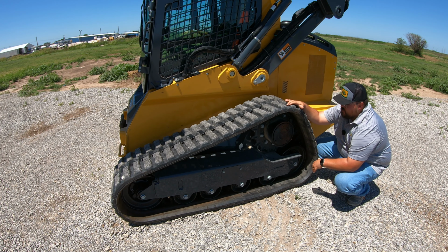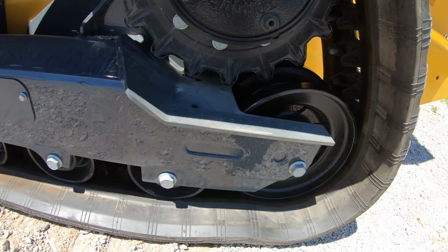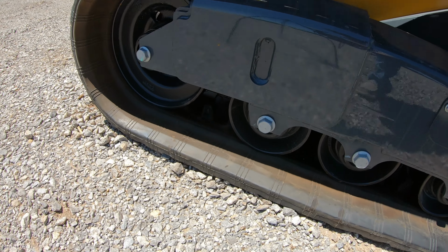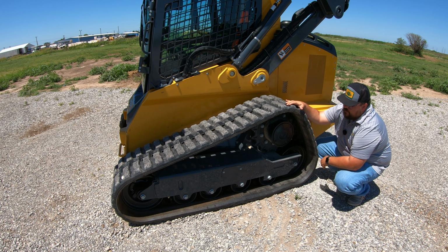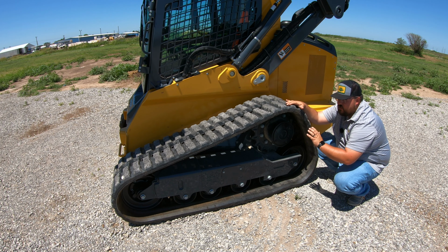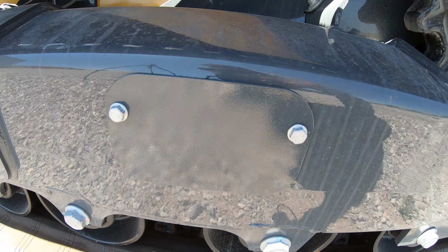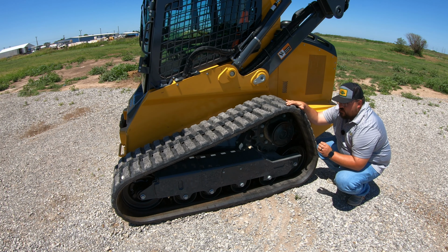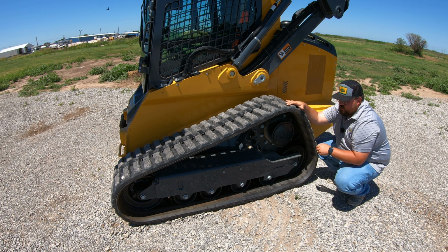Now, a little bit about the track system here. What you're going to have is a single drive gear here on each side that runs this track, along with 2 large idlers and 4 smaller idlers or rollers here on the bottom. This is going to make up your track system. Now, this is going to be adjustable as far as the tension on these tracks, and this is something that you do need to check. So right behind this center plate here is going to be a grease zerk, and we simply need to add grease to this to add tension to this system. Now, if you want to see how this is done in detail, I have done a full video on this, and I'll make sure to leave a link to that down in the description below.